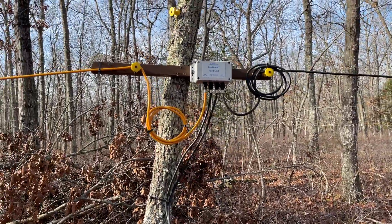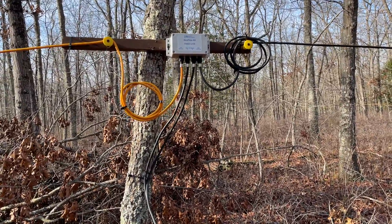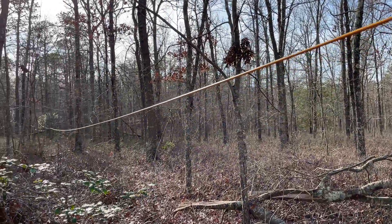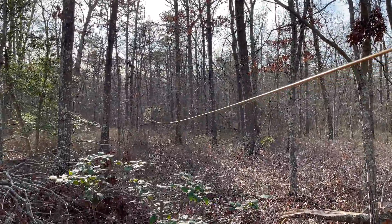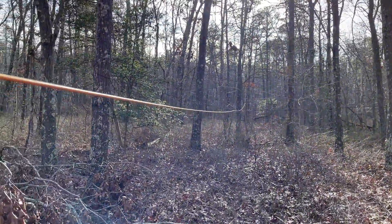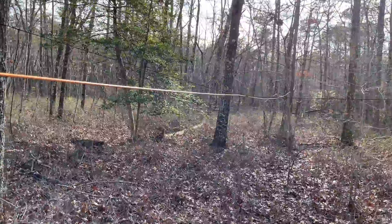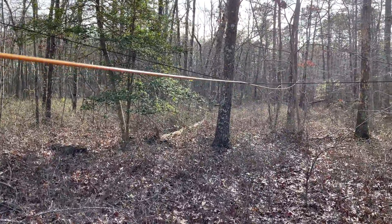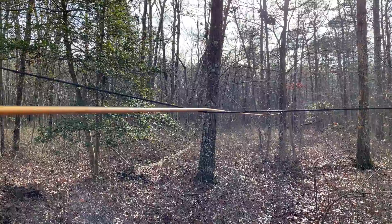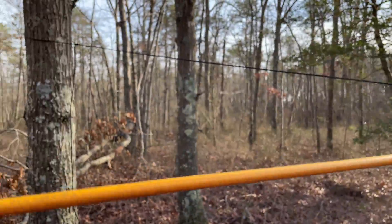This is the midpoint of the northeast-southwest beverage, with two feed lines back to the shack. I'll show you how we string the beverage through the woods, looking for strategic trees to keep the beverage element constructed out of RG6 coax. The BevFlex antenna system allows you to feed the beverage at any point along its length. In this particular case, it's fed right in the middle, 300 feet from each end, in places where I don't have a tree.